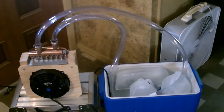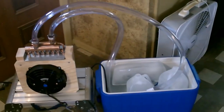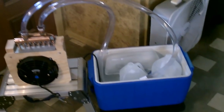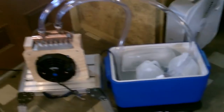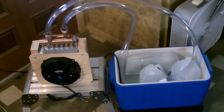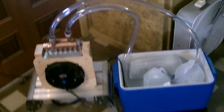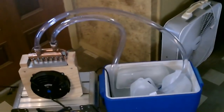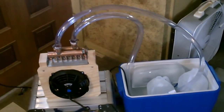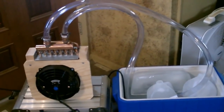We've got the 7-inch car radiator fan running on solar, and the air-to-heat exchanger which doesn't run on anything. Then we've got the water pump in the ice chest with two frozen gallons and a frozen block of ice. The water is down to about 45 degrees and the air temp is down to about 55 degrees — and it's cranking. That's a 1500 CFM fan going full blast right now. This one couldn't be better, working absolutely awesome.